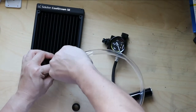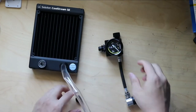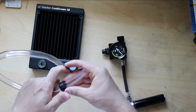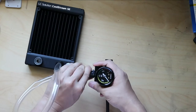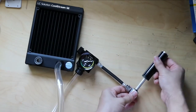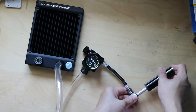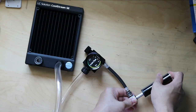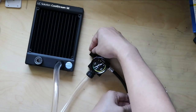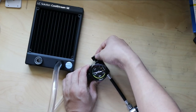Next, we connect the soft tubing fittings to the main body of the pressure gauge and to the component that you want to test. After everything is connected, we can pump air into the system. As we pump, we should monitor the pressure gauge needle. You want it in the green zone, just after 0.5 bar, and turn the valve into the off position, closing it.